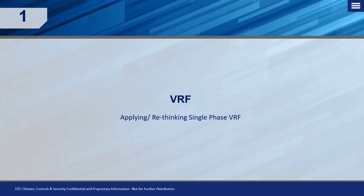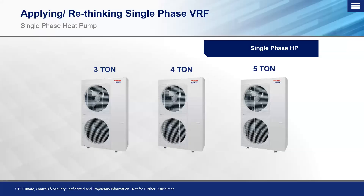Now we know why we're looking at the single-phase VRF as not only a substitution but finding its sweet spot in residential applications. You'll notice the outdoor units bear a striking resemblance to the three- and four-ton ductless multi-zones with the dual fans — because essentially that's what they are. We look at the Toshiba Carrier single-phase VRF three-, four-, and five-ton machines.